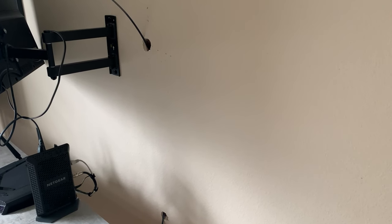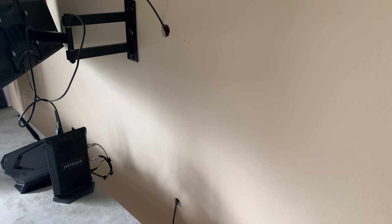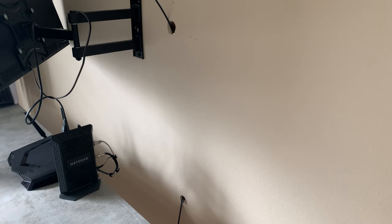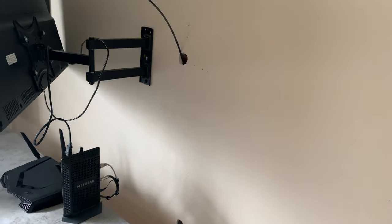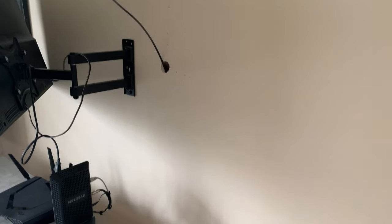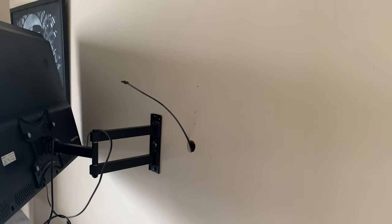With the power cut in this room right now, I'm just using the light from the window so I don't electrocute myself. I have this fish line ran up there and finally — it took a while — I had to kind of push and blast my way through some insulation in there. Hopefully I didn't destroy too much of my insulation; I'd like to keep my electrical costs down. I was able to fish that up there, and now I'm going to tie off the power cord and the HDMI cable, tape them off, and pull them down to that bottom hole.